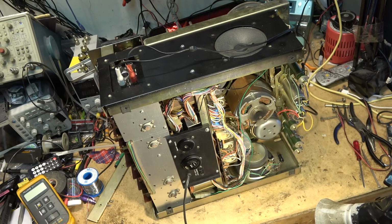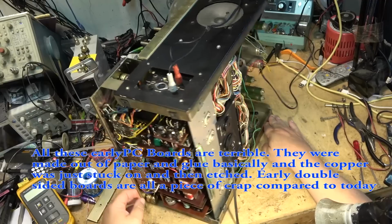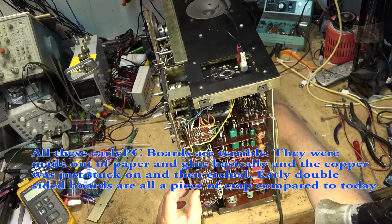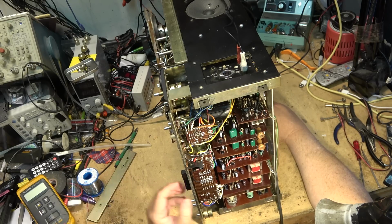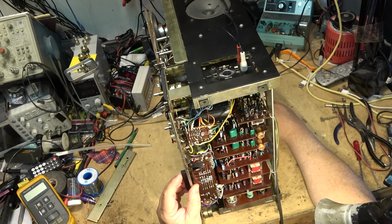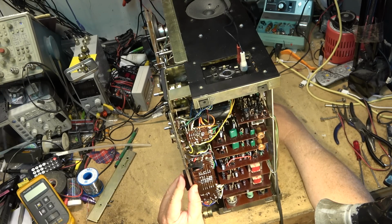And check for some voltages and see whether we've got voltages that are supposed to be going to the record boards. As I've already pointed out, I can hear the erase head clicking on and off, but like when I switch it here, except for this one, doesn't do anything. That's the previous recording that was on the tape. So it is erasing.